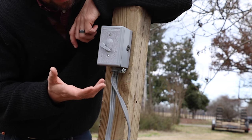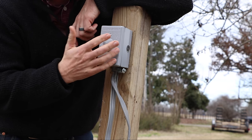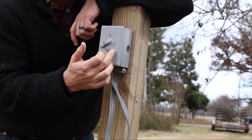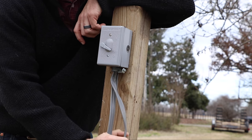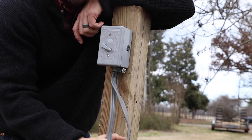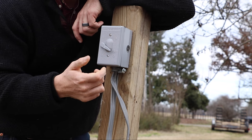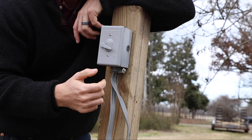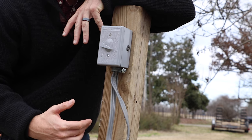For our light switch, they make these great boxes that are waterproof and weatherproof — they're metal. This switch right here is basically just flipping a regular light switch inside the box, and this powers the light on our paddock. Very simple to install. Again, probably the biggest problem I've had is working with these 10-gauge wires, so I may drop down to a 12-3 from the 10-3 I'm currently using, just to make sure the wires fit into the components properly.